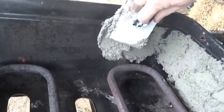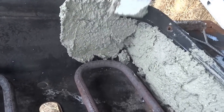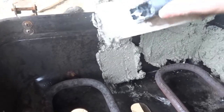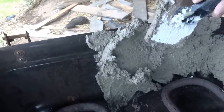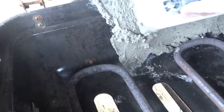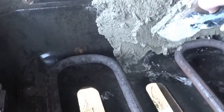I'm gonna start working a little bit on the back, trying to make it so this will actually butt up with the refractory coating that I put on the lid. I'm gonna try to put it on halfway decently thick — I don't want it too thick where I have problems, and I don't want it too thin where it cracks as it dries. I might just have to replace the burners eventually anyway.